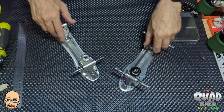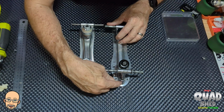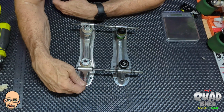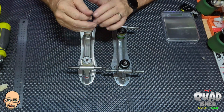Conversely, on the front, where the stopper and the pivot pin go in, they're very small, but here it's quite a little bit bigger. Because that's such a big boss as well, you can't quite go as forward as you probably would normally go if you went with these ones. So that's one design flaw.